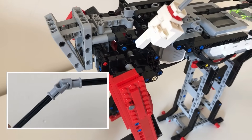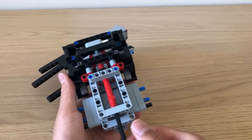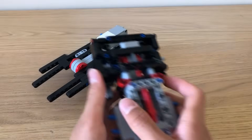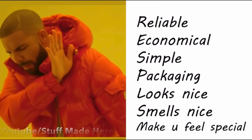Using these universal joints, the legs are able to move while the model is steering. Unfortunately, there is a slight flaw to my steering mechanism. When a real vehicle steers, the inner wheel travels a shorter distance than the outer wheel, so it needs a higher degree of rotation. Unfortunately, I couldn't get this to work on my model. But who cares? It doesn't even really matter.